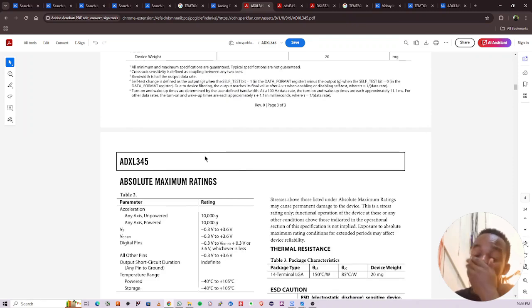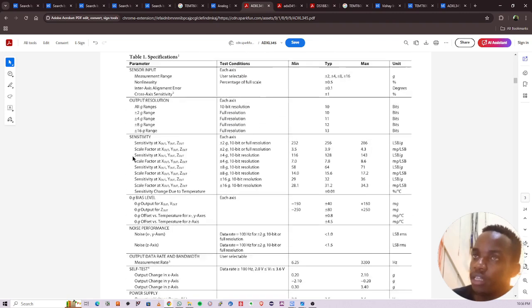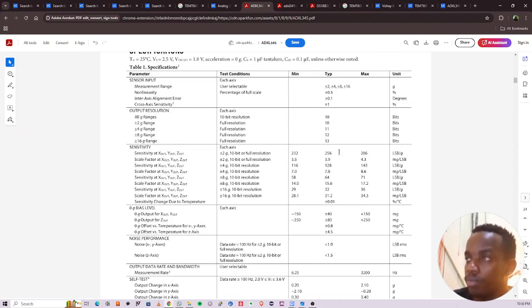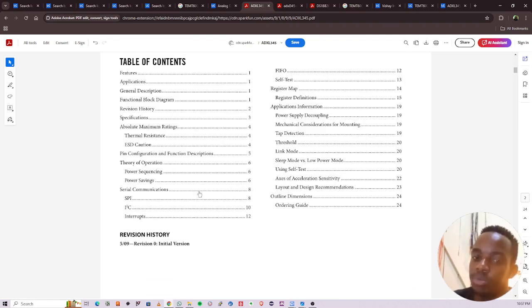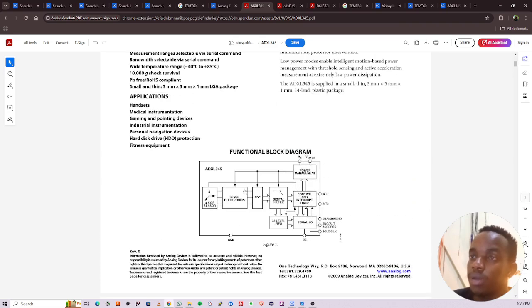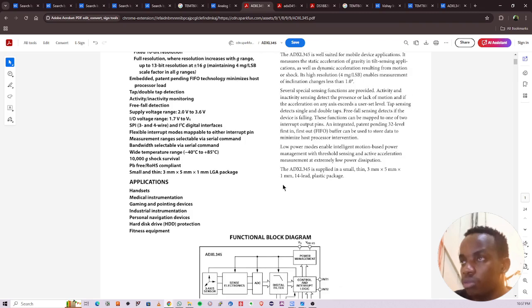So what I'm thinking, you can do sensor fusion. First of all, I chose the ADXL because it's highly sensitive and it has a larger bit range than the MPU 6050. The MPU 6050 combines both the gyroscope and the accelerometer in one. So we can use the 6050 for gyroscope and also for acceleration, and then combine all of those readings, get the offsets, and I'm sure we'll have better measurements. Someone would have used just an MPU 6050 for that, which is okay because it combines both the gyroscope and the accelerometer.